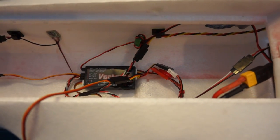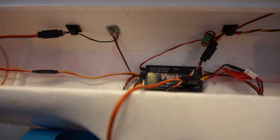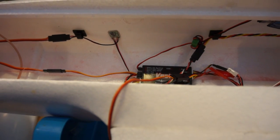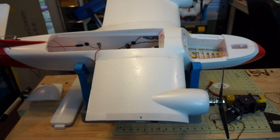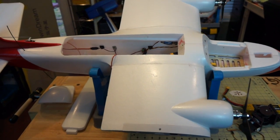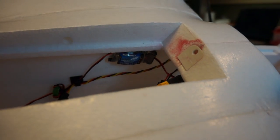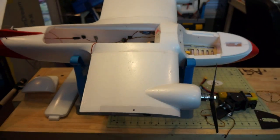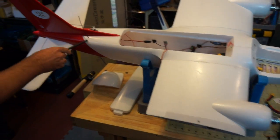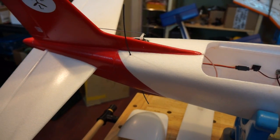When you fire up the aircraft for the first time it beeps for about two seconds. If you don't move the control surfaces for one minute it begins a steady tone, and after two minutes it starts a warbling two-tone sound — it's going to help you find your aircraft if it goes down in the woods or tall grass. We have a BEC mounted up here — it's a 5-amp Turnigy BEC. The dipole is mounted through the tail with the top and bottom elements coming out, and it's an ImmersionRC semi-rigid dipole.